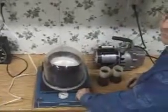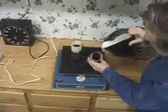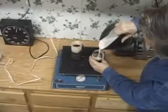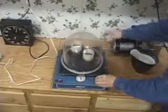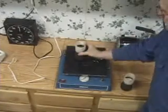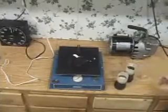The vacuum is turned off and the flasks are filled about 3/4 full. It's a good idea to pour the investment down the sides of the flask to avoid pouring directly on the model. The flasks are vacuumed for about 2 minutes and allowed to sit for about 4 hours before de-waxing and burnout.